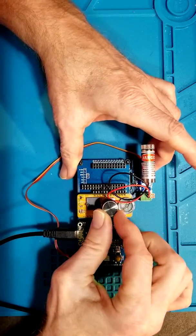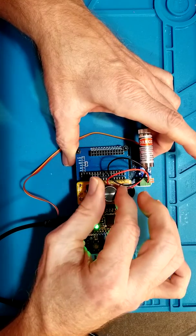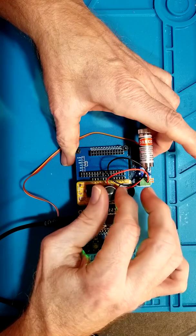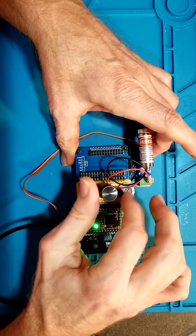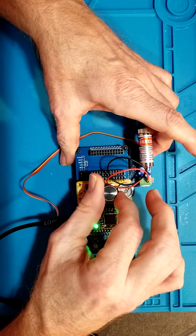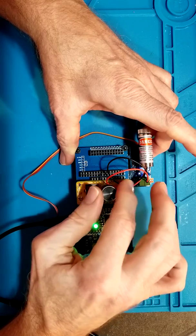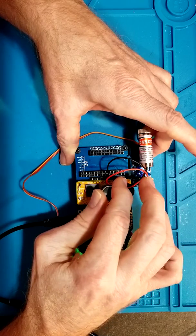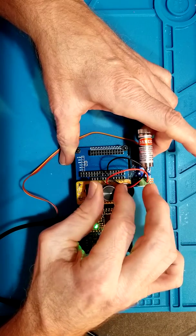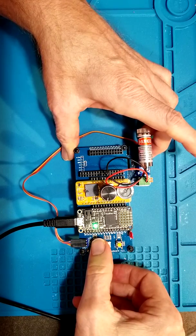This is the rotary encoder knob right here. As you crank it one direction, you'll notice that it prints out higher values, and as you turn it the other direction, it decreases those values, or increases depending on which direction you started. Also notice how the values are plotted here, what this motion is. It's jerky. It's not smooth like the potentiometer was. To finish this test, it said press SW0 to continue.